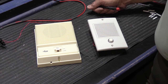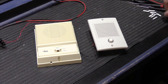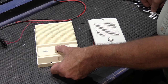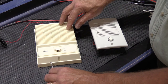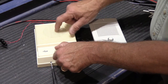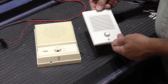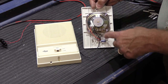I'm not going to go over that conversion here because there's another video in this playlist that shows you in great detail how to do it. But I wanted to show you that it actually does work. If you push the button, you get the chime tones, push to talk — I don't have it turned up very loud because if you turn it up really loud you get a lot of really annoying feedback. This is a model NDB 300 WH — WH for white — and it's been converted on the back to take the place and operate like an IS68.